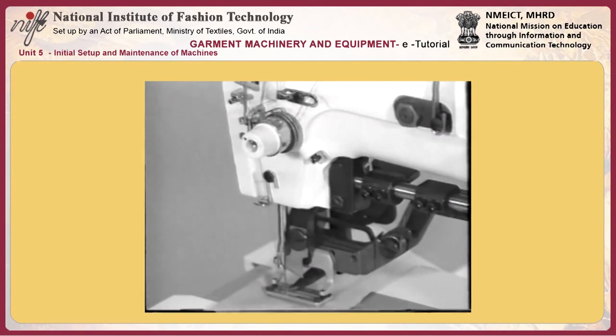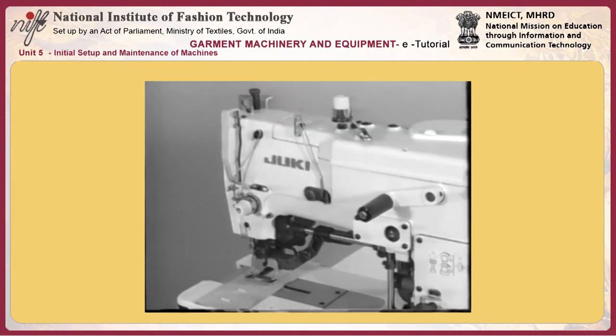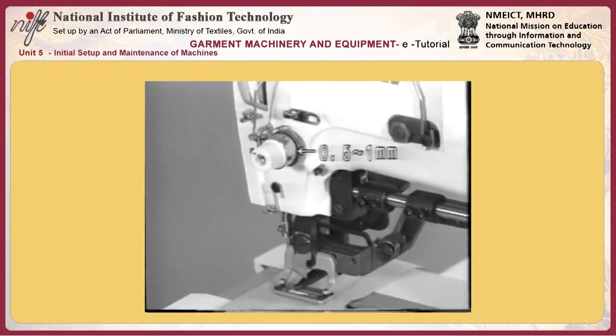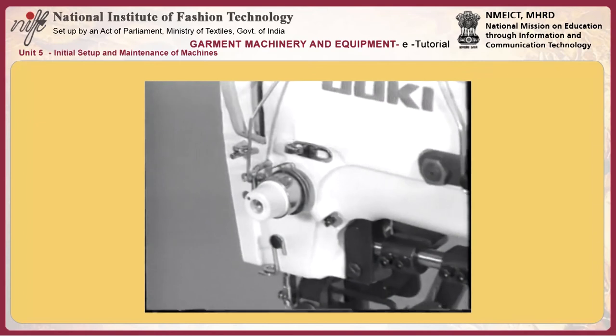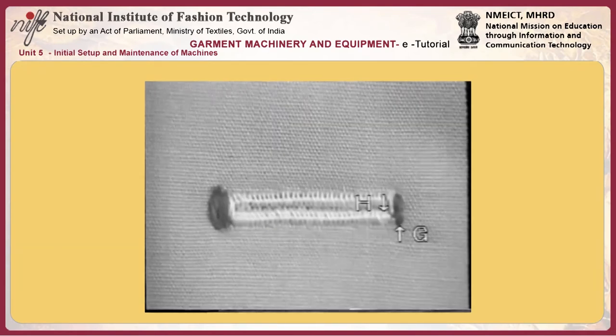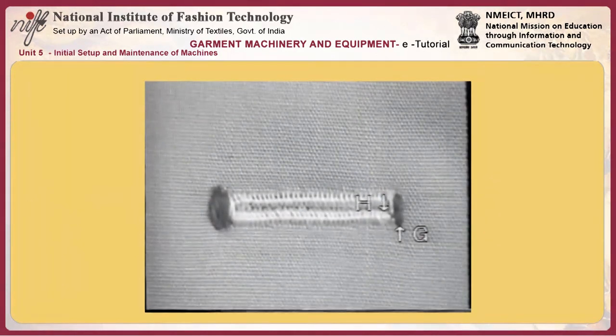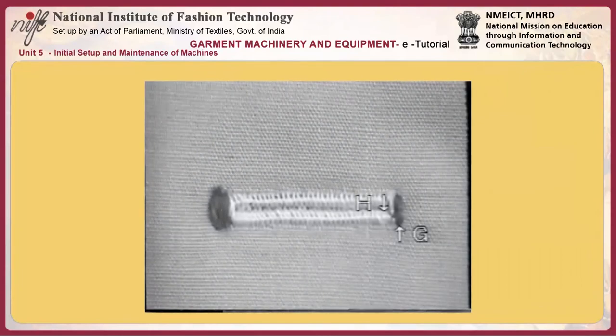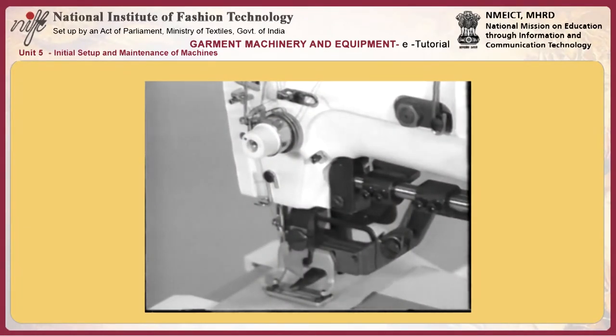If the bobbin thread is trimmed too short, suppose that the bobbin presser picker provides an excessive pressure. In this case, loosen adjusting nut C and turn adjusting screw D counterclockwise to decrease the spring pressure. Turn the adjusting screw clockwise to increase the pressure. If you have replaced the hook or any other part that can affect the bobbin picker unit, check to be sure that the top end of the bobbin winder trip latch meets the recess hole in the hook. If the top end of the bobbin picker does not meet the recess hole, loosen set screw E in the bobbin winder trip latch and adjust the height of the latch.